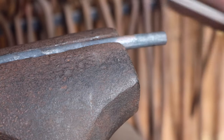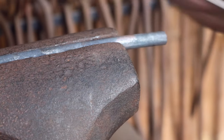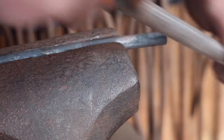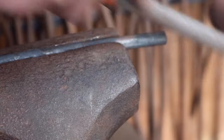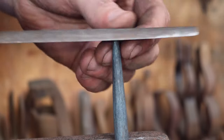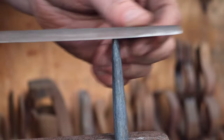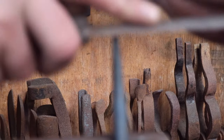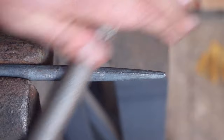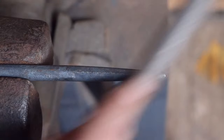Once the end is chopped off, remove those sharp corners with a sander or file. If your file or hacksaw haven't been biting up to this stage, you may have made your tools too hard too early. Reheat them to a forging temperature and try annealing them again — remember, let them cool off for as long as they need. You can even bury them in sand or vermiculite to really slow the process down. Your punch will also want a little bit of filing right at the top. To keep an even point, you can also do the exact same thing you did with the hot rasp here and go over those rough edges, really making it as round as it can go.